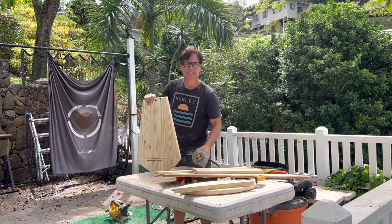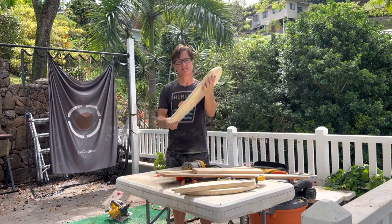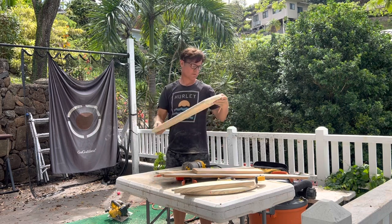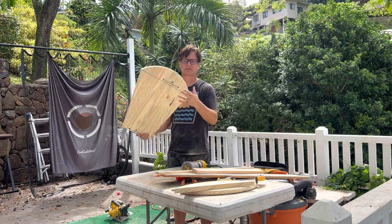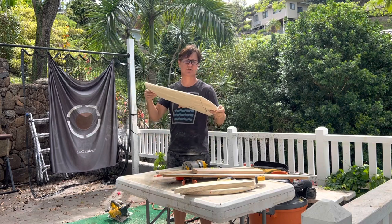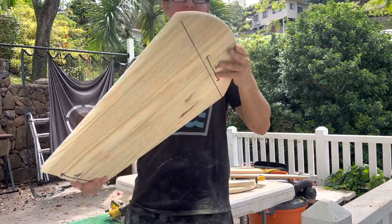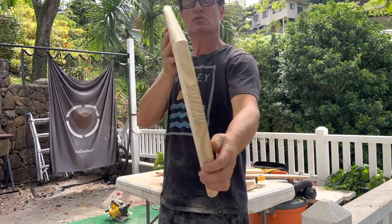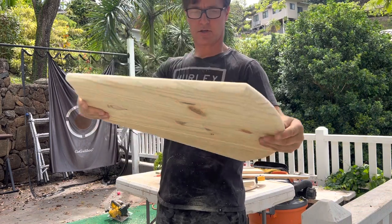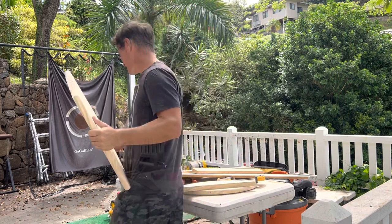All right, just because I have one, I've rounded over the cut edges with my router, but if you don't have one of these, just hand sand them, just so they're not sharp. There you go. See a nice bull nose on those. So if they catch anything, not gonna hurt.